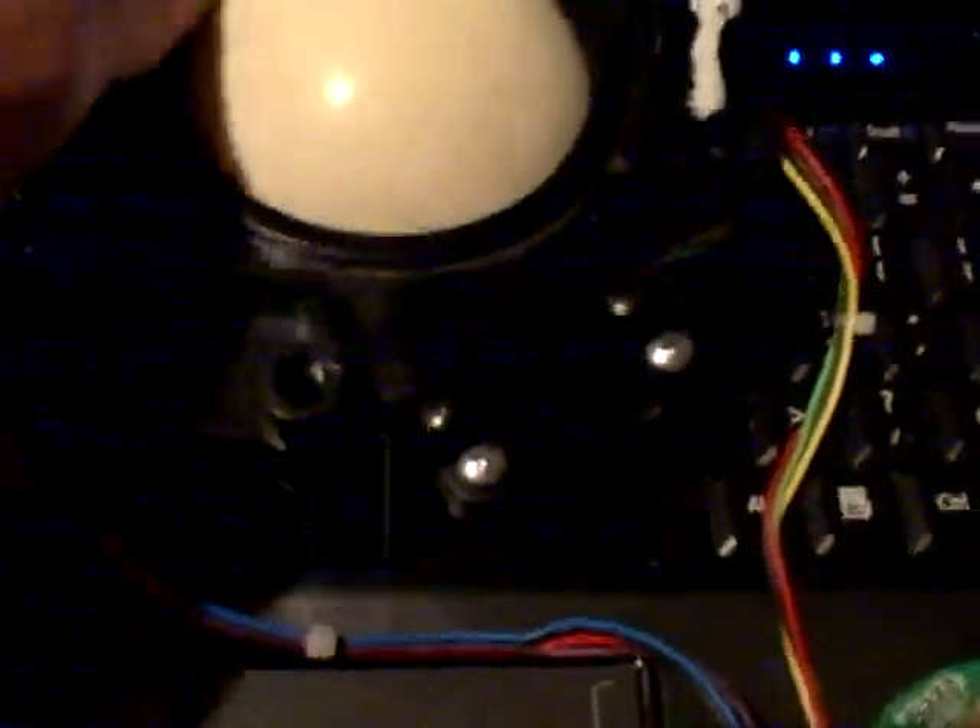With me, I just happened to get lucky and got the polarity of these correct. But if your mouse is going in the opposite direction than intended, just swap those two wires around with the two wires that you soldered on the board. Any questions, just leave a comment and I'll get back to you shortly.